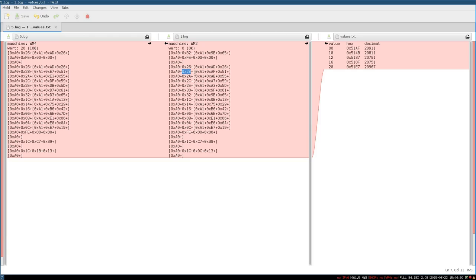And I've taken the value. We also know it's encoded in little endian. So I've taken this value here, and these are the several other values. For example, for 0, we have 51AF. As you can see, 51AF. And this corresponds to this decimal, 20,911.